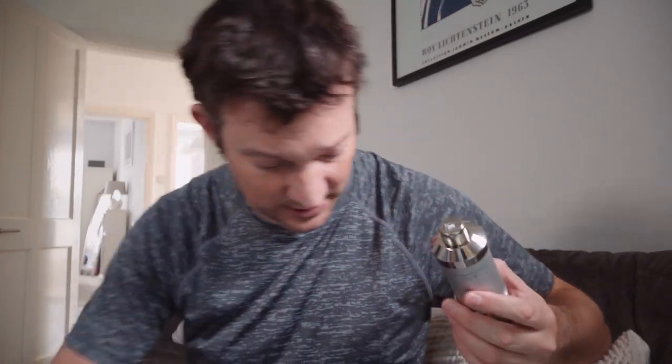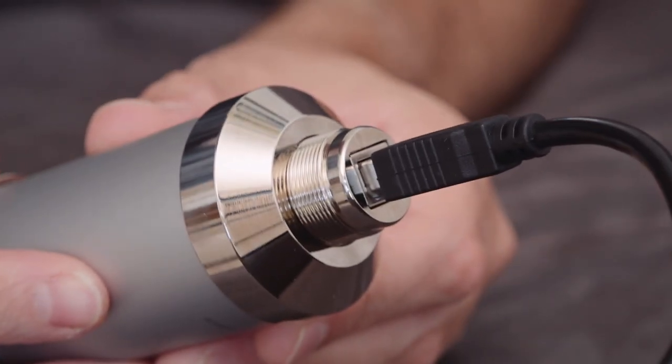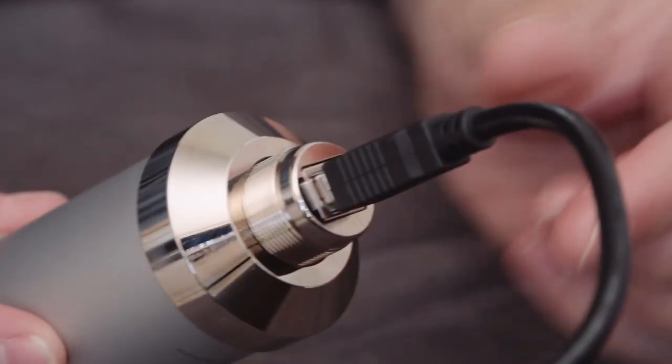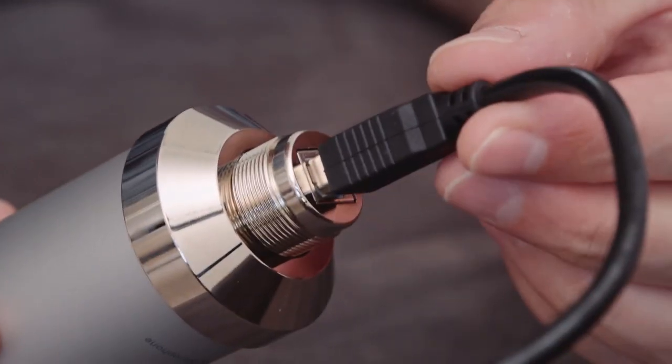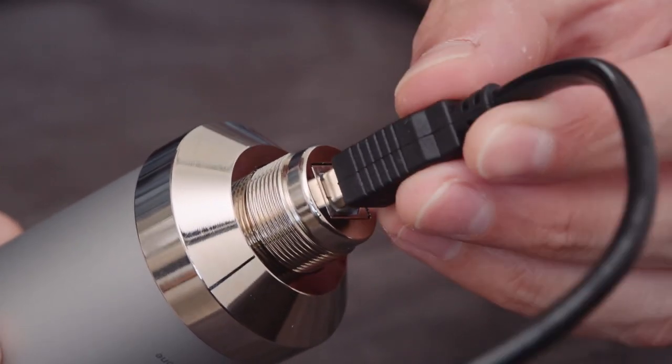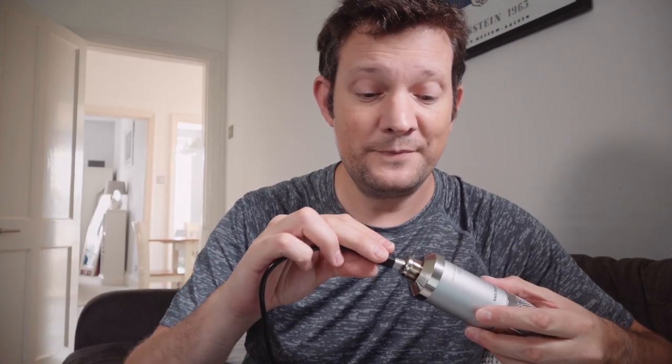As far as I'm concerned, having to plug a USB-B cable into this port is a point of failure. If you pull it hard, this port is going to break and you'll be left with a microphone you can't use. It's a bit wobbly — it's not a perfect way to do it — and just from moving the mic around you could potentially get quick wear and tear on this port. USB-B is probably the best connector you could use here because it's pretty thick and sturdy, but having a cable that can be disconnected and reconnected is maybe asking for trouble.